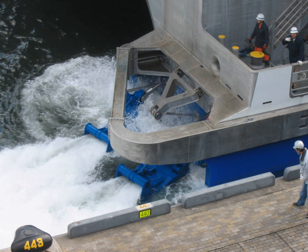An axial flow waterjet's pressure is increased by diffusing the flow as it passes through the impeller blades and stator vanes. The pump nozzle then converts this pressure energy into velocity, thus producing thrust. Axial flow waterjets produce high volumes at lower velocity, making them well-suited to larger low-to-medium speed craft, with the exception being personal watercraft, where the high water volumes create tremendous thrust and acceleration as well as high top speeds.